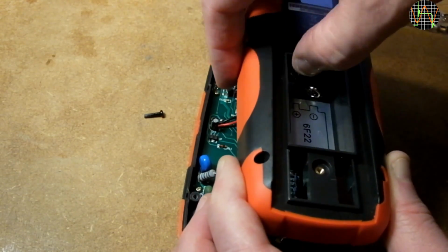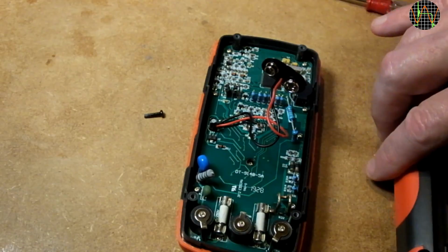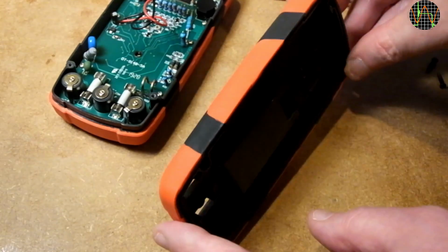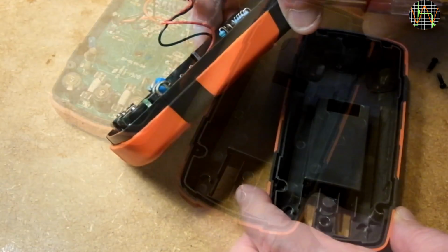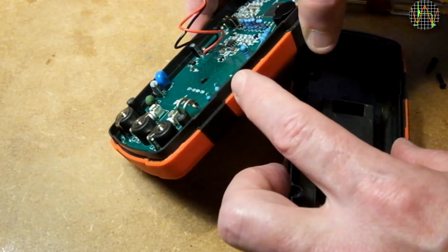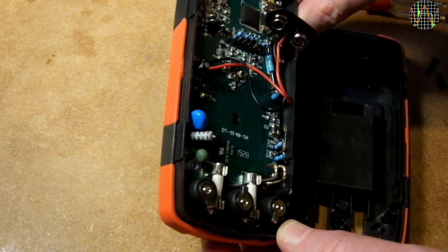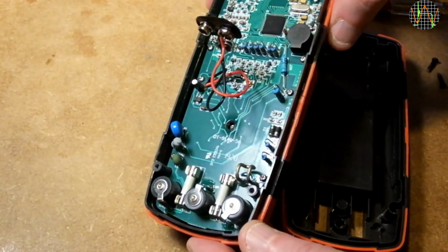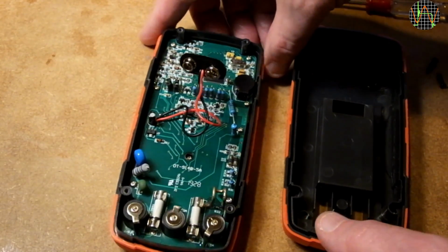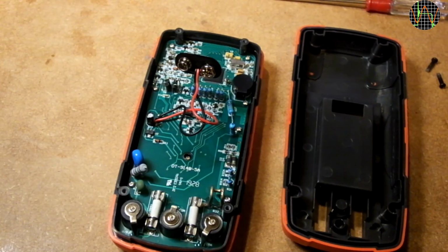The housing is held together with 4 self-tapping screws. The back shell does not contain any shielding, which you often see in other meters. I like the deep groove that goes all around. It matches the large rim around the top part to make a very tight seal. The main purpose is of course as a blast shield to contain electrical arcs to prevent injury when you're holding the meter in your hand while measuring high energy circuits and something goes seriously wrong.